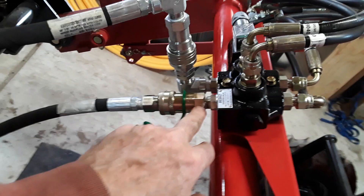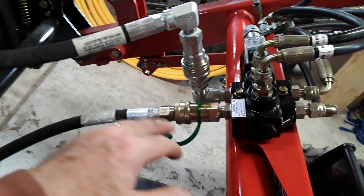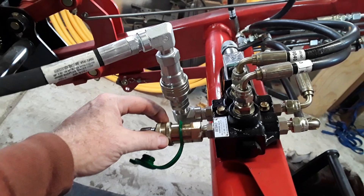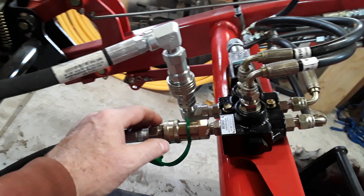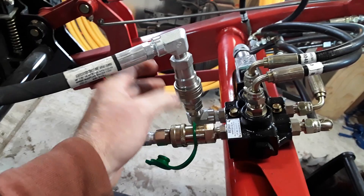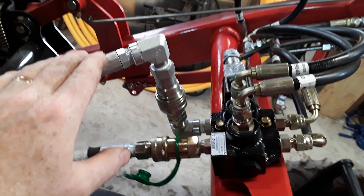As far as hydraulics go, I never really figured out what the couplers are that came with the third function kit. I did note that these little adapters are 3/8 pipe — in fact these say 3/8 on them. So I got a male-female 3/8 coupler set, figuring if they didn't match I'd essentially have one pair and I'd have another. That's what I ended up doing because they're not the same — the 3/8 is definitely much bigger diameter, as you can see in the rings. One issue with the 3/8 is there's not enough clearance because of this small distance; the locking rings interfere with each other. So I used a couple of elbows I had bought — my intention was to elbow out of the cylinder, but I actually used them here to get this guy up and out of the way, and that's working pretty well.